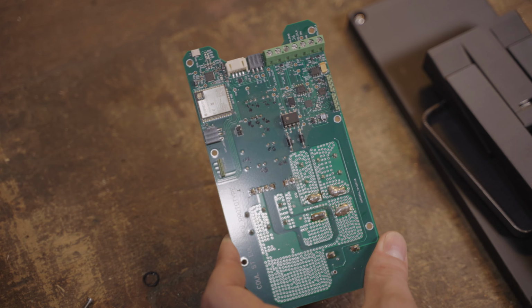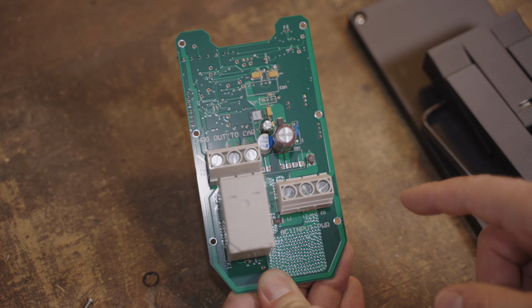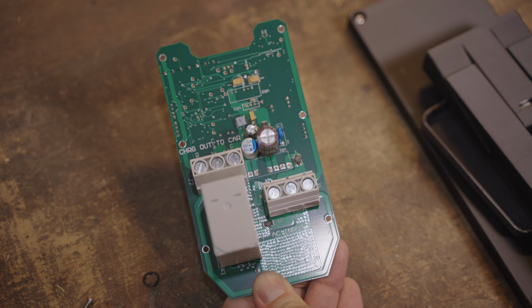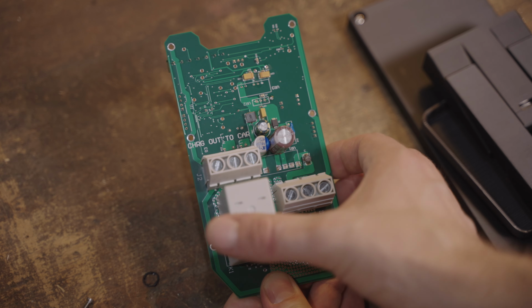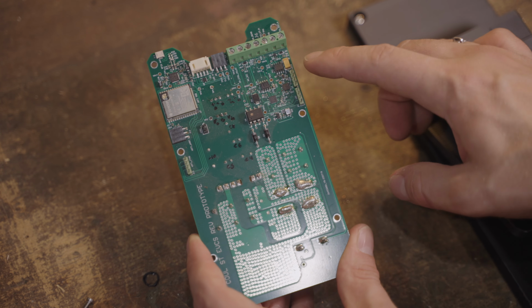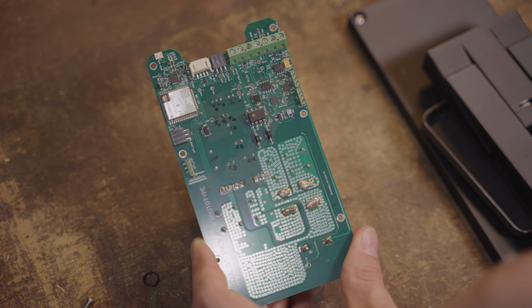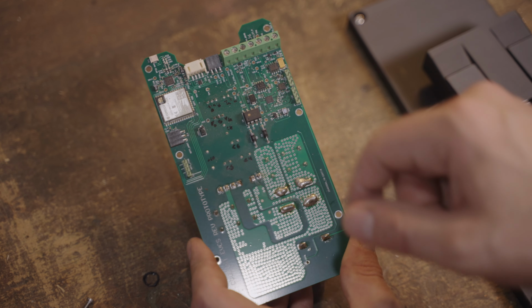Yeah, so this thing didn't work. The first issue we had was actually on the varistor, which is not on here anymore. I took that off. It was the wrong size. It would trip the circuit breaker as soon as I turned it on. And then the other thing I found was, I believe this cap here is on backwards, but there were other issues. You can see I have drawing all over this.